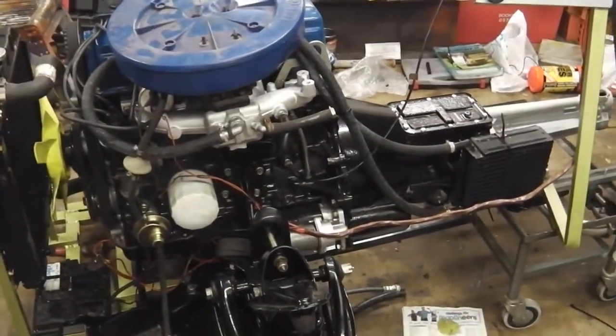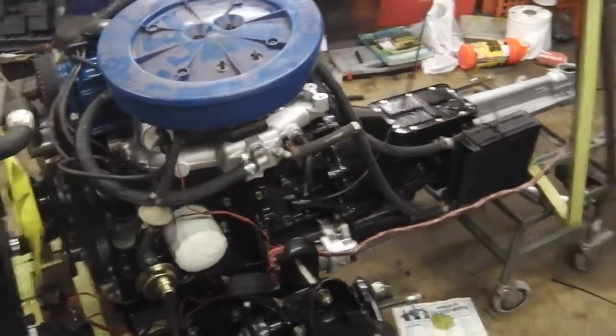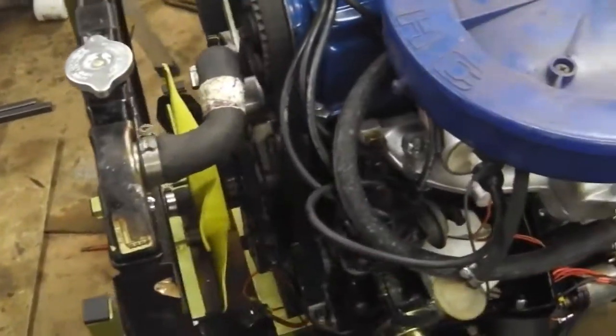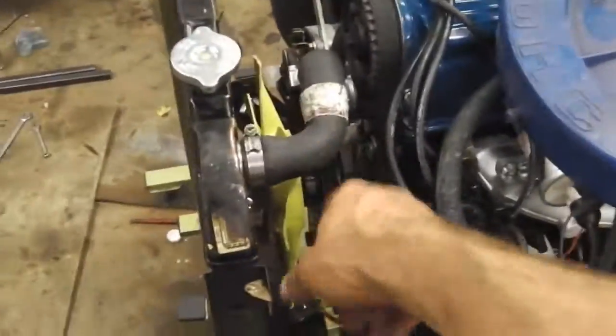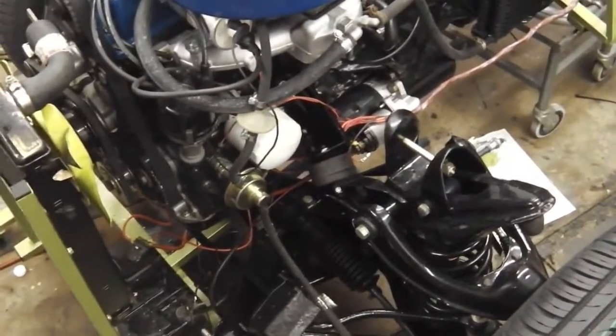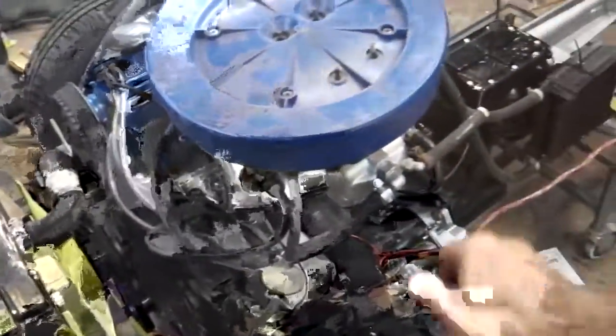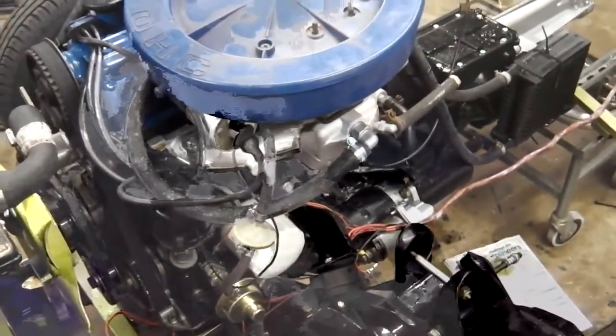Could be the 5th, not sure, but just a quick 5-minute video showing you the hot run of the engine, rad fitted, rad converted to front fitting with the crep pipes, so all done. And just wants the dwell angle, plug gaps, timing light on it, and then we should be able to get it up to revs. It's not going to rev up at the moment with no vacuum advance pipe on there, so we need to fit that. But we're nearly there with that.